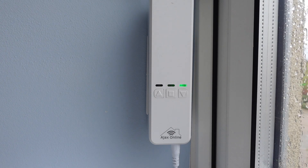Once you've done that, do the reverse on the down button - single tap on stop, and that should be it. Test it at least once: press up and see if it goes all the way and stops at the right point, then press down again. If you get this wrong, I would suggest you factory reset it and try again.